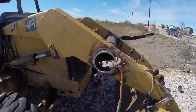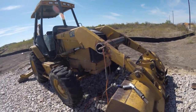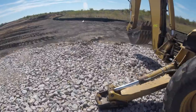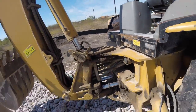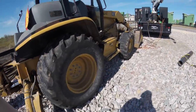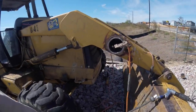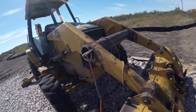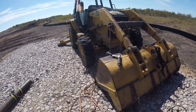And then, the next important thing is to make sure that this tractor is level. If you weld it with these arms like this, of course your bucket's not going to sit flat on the ground. So what I like to do is come out here. Hopefully these don't leak down too fast, these are outriggers. But I like to put a level right in here. That's usually a pretty straight section of the tractor. So once that part is level, then I can come back over here and I'll probably use my jack stands. I'll see if I can fit them underneath the bucket somehow, or maybe under the edges of these arms. Just catch that a little bit and make sure that is level as well before I tack that cross tube in there and make sure that that's in the correct position. So that's the next step for now. So hang tight.